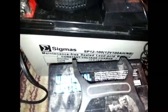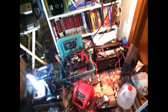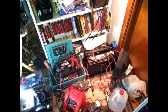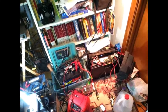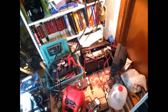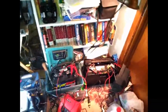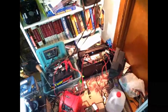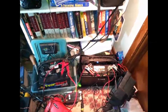I already have one that's pretty beefy — a 100 amp hour UPS battery, about six months old and still in new condition. But that one is designed for UPSs. I want to get a gel cell designed for solar because those won't dry out as easily as regular AGM batteries. If I can't find those, I've already talked with the Interstate Battery distributor in my area and had them look up their inventory. They do have some used Group 27 and Group 24 batteries I can pick up relatively cheaply, in good condition, load tested. They'll probably last a pretty long time. So I might end up picking those up just to hold me over until I can save up for a brand new, good quality battery.